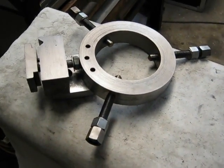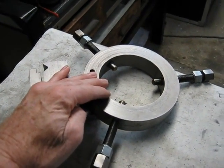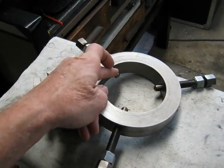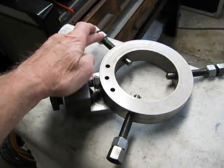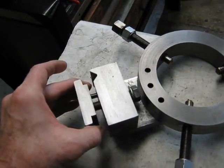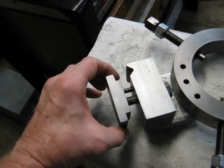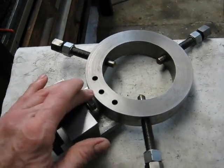It's made out of scrap from my scrap bin. As you can see, it's a big diameter — I want to take good sized stuff. Three adjusting bolts with bronze tips — hard bronze brazed on. I've got lock nuts, and here's the block. It just bolts up from the top. It's a threaded block with a rolled pin in it so that it can't twist when you're tightening it up.